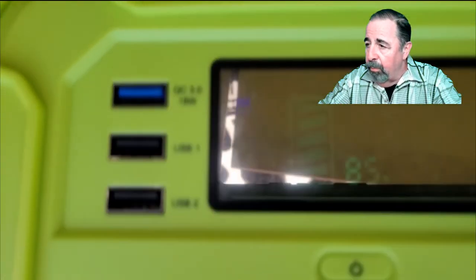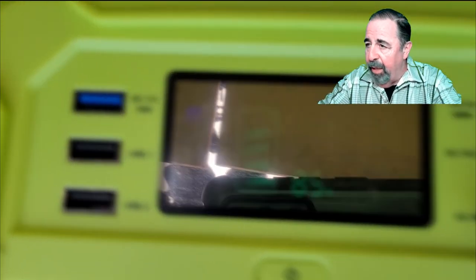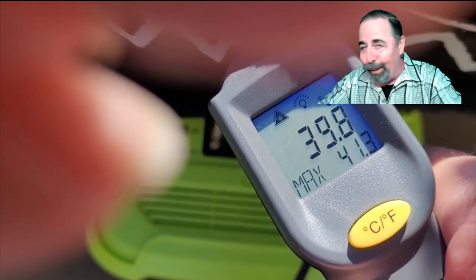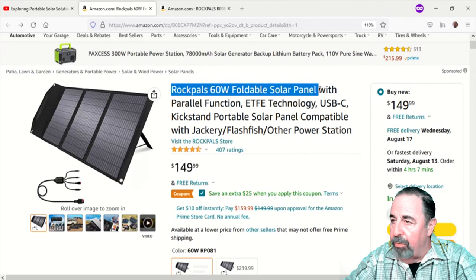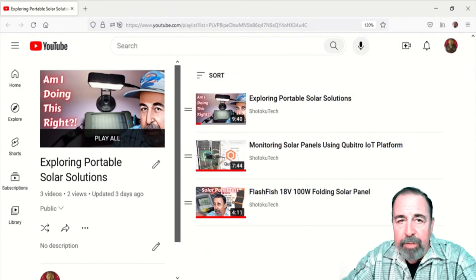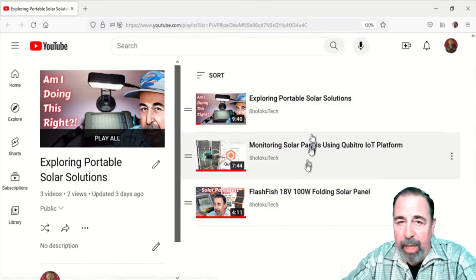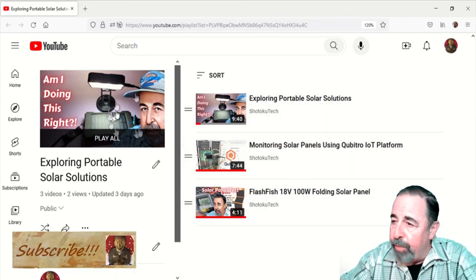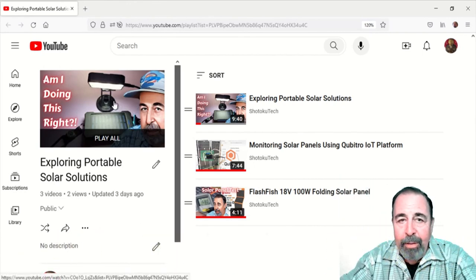At 85% you can see the efficiency drop off — it's at 21 volts, down from the original 23 volts. Checking the temperature of the battery: 40 degrees centigrade, so not too hot. I had to keep it in the shade. The interesting part is you get the solar panels in the sun and keep whatever you're charging in the shade. I hope you enjoyed this look at the RockPals 60 watt foldable solar panel. If you buy two, make sure to look for the free coupon for the Y cable. Leave a comment below if you have experience with these panels or any questions, give this video a like, and please subscribe. Thank you very much.